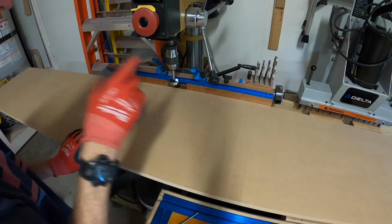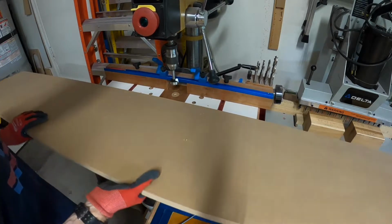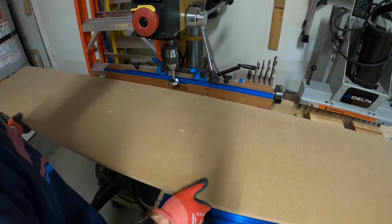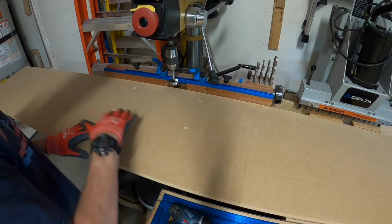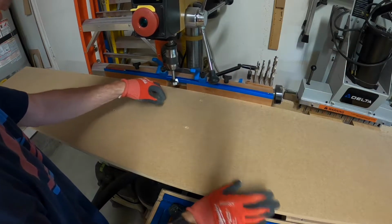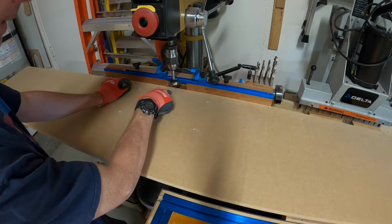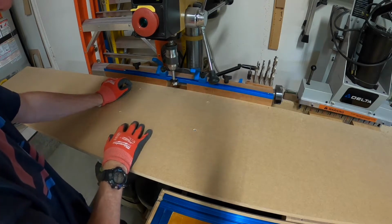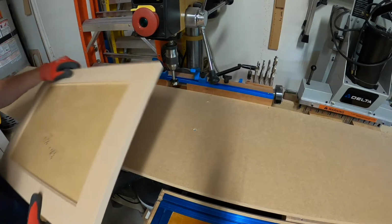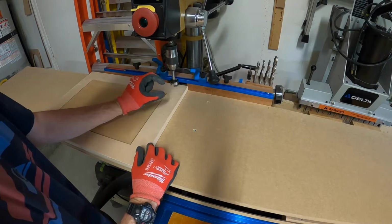So just as I did in the last job where we had those really big doors, I'm putting on this panel here. It's just 3/4 inch MDF, regular MDF, heavy. So it's actually bowed this way. When I put it on here, it flattens out and remains pretty flat. In fact, it doesn't even deflect right there, hardly at all. So that's cool. It takes away a little bit of the suction because the hole becomes smaller, especially when you put the door up there. The door shuts off some of the suction. So if you look at it, you can see it's only getting that much suction.